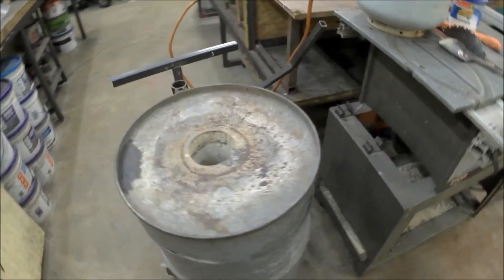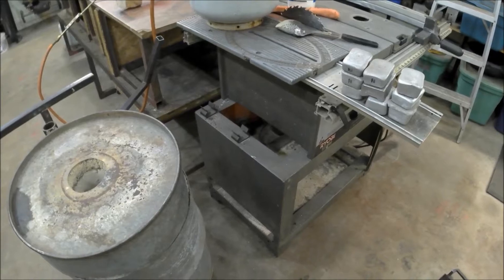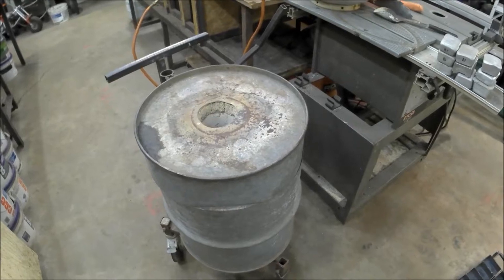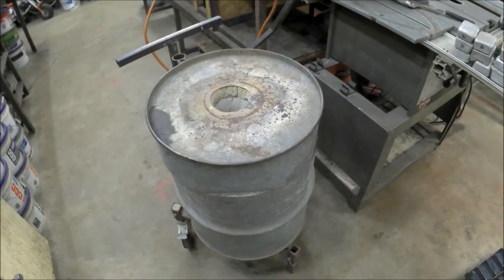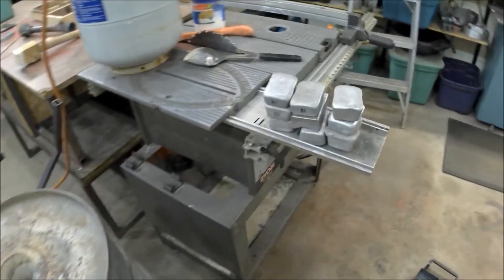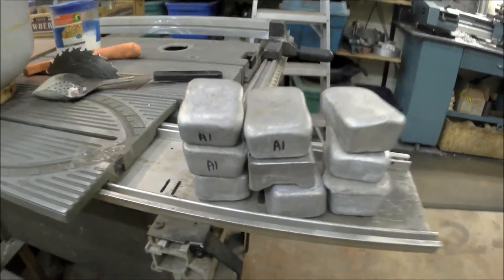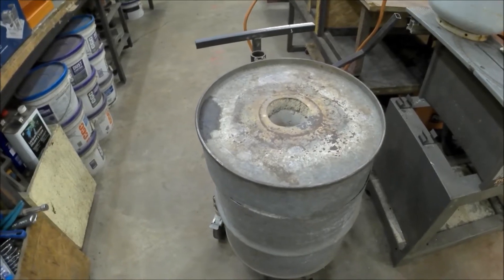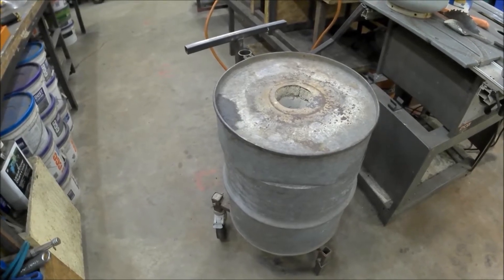What I actually do is hold the burner right against the aluminum ingots for the first maybe five minutes or so. I find that it heats up quicker, and then I reposition the burner to where it normally sits. That melts the aluminum quite a bit quicker, because the ingots are fairly big — there's a lot of solid aluminum there. Pointing the burner directly at it, as opposed to heating up the air around it, works a lot better. So I'm going to set up the camera, load up the ingots, and heat up the furnace.